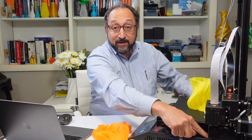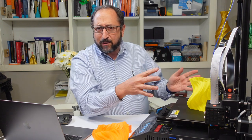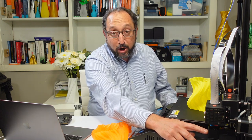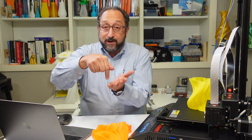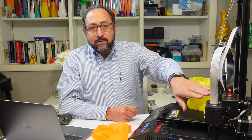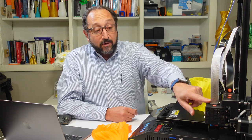The assembly of this printer was quite easy. Basically you take the upper gantry, slide it into two slots in the base, then slide the base off the edge of the table to get underneath — it's quite heavy — and put two bolts on each side. That's the hardest mechanical part. After that you bolt on the filament brush attachments with single bolts, attach the filament reel holders, and connect the cables. All cables are clearly labeled with numbers matching where they plug in.